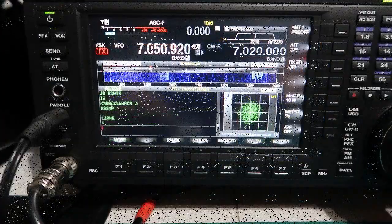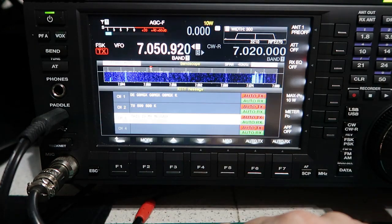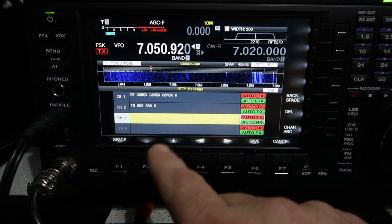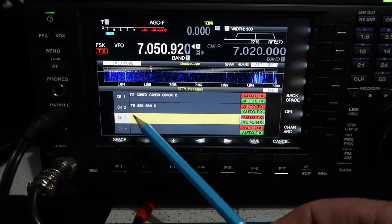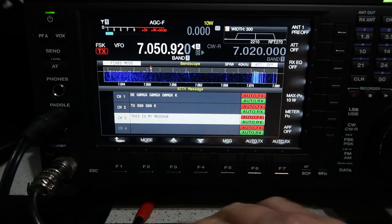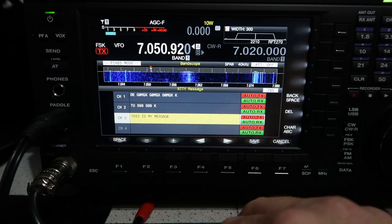The other thing to show you is transmission in RTTY mode. Looking at the screen, you'll see a number of options - Memory is the one to look at. Memory is where you go to edit and store individual messages for transmission. I've got two set up by default - a traditional from my callsign three times and a TU 599 K. Looking at a particular message, use the up and down arrows to select different messages, then click the message button to edit it.